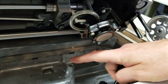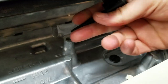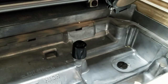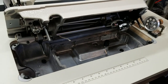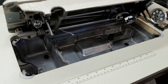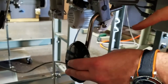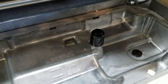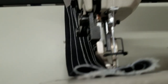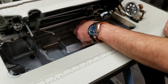If you find the machine with a hole in there, there is nothing wrong with it. We call this the umbrella and it sits here. Whenever your machine needs the presser feet to go up and down, this goes up — you see that — it makes the umbrella go up and makes the feet go up right here.